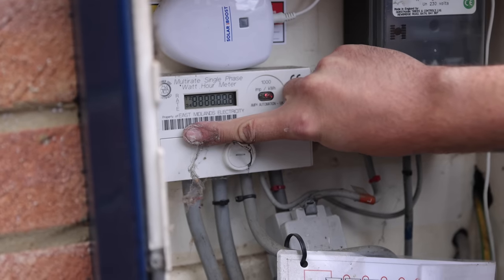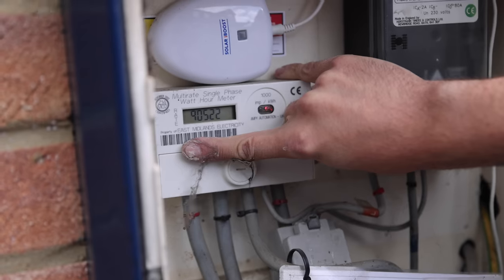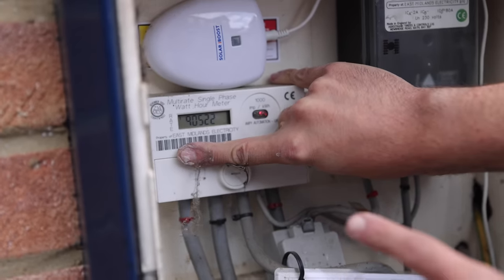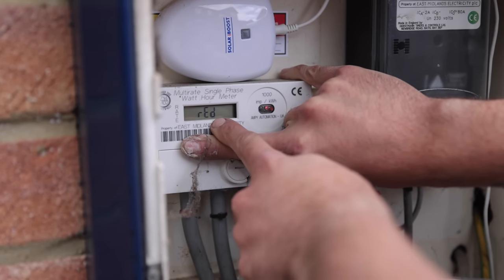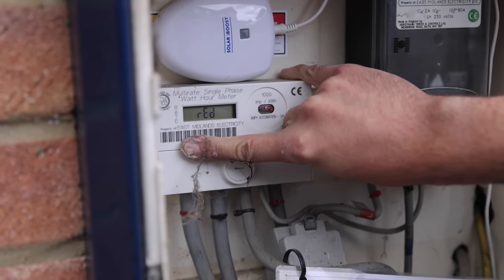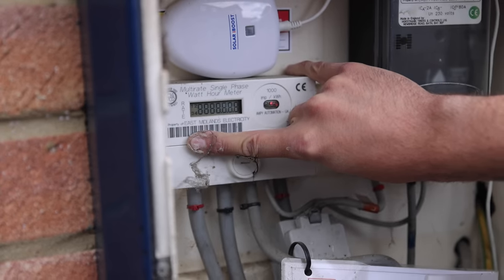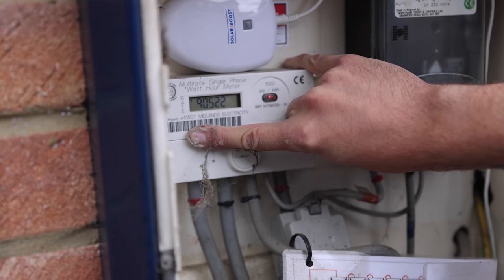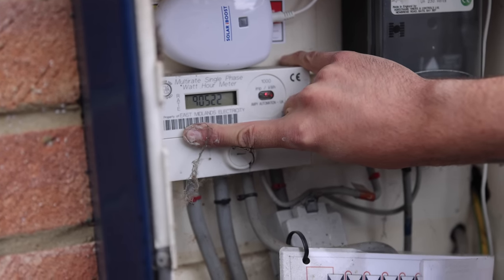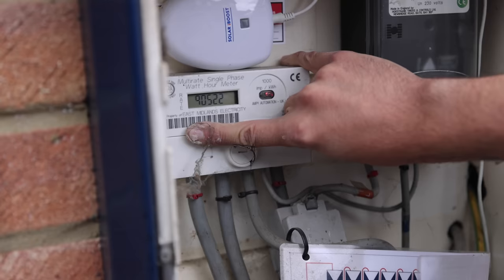I can show you something outside on the meter. On this meter, as we've got solar, these old two-rate meters will display, give it a second. Here, there it is. Red, reverse energy detected. So the meter's grassing on you for running the meter backwards, basically. But with solar energy, it feeds back into the meter and it will always display red, saying that it's had energy pass the opposite way. They won't clock backwards, these digital meters. The old analog ones will though.